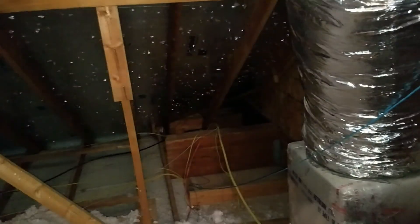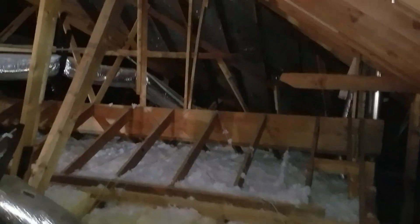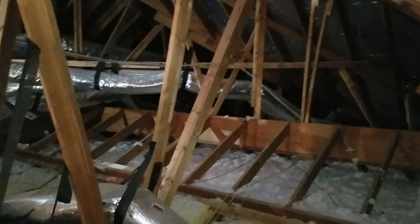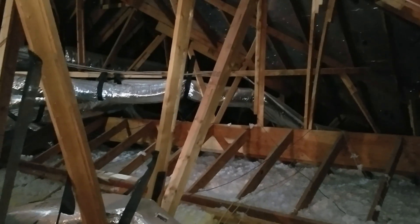It goes down all the way into the crawl space underneath — that was really difficult to get in. It comes across; I still have to nail it down with some little tacks, all the way over that ridge, all the way into the back corner. It's 120 feet of Romex. We've got the 8/3 wire. Our soffits are below the roof so you can't really get down to the soffit. Remember you need two feet of wire once you're in the panel.